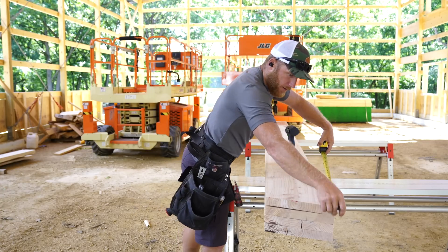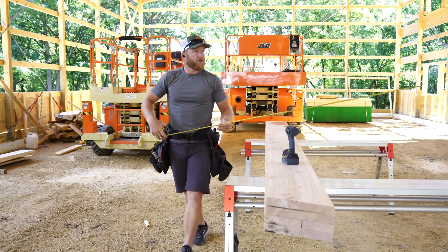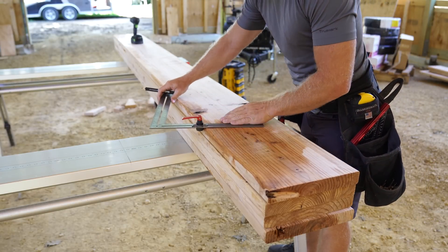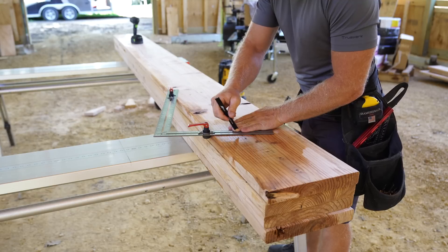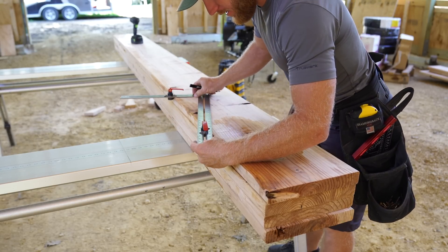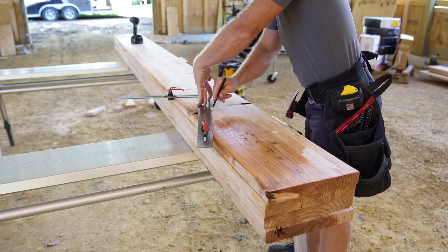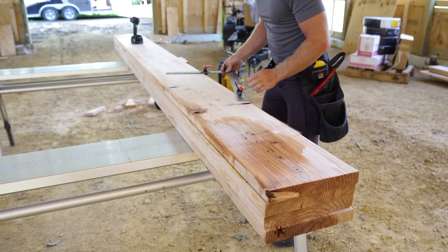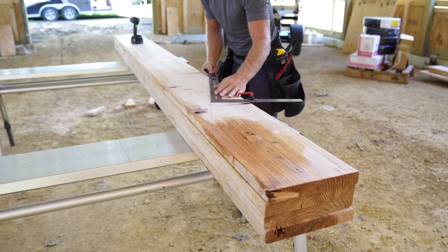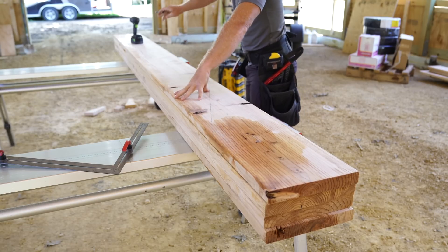I hook the tip here at ten foot seven and a half, and that is the long point of my reverse 4/12 pitch. When I say reverse 4/12 pitch — if I put this square like so, it gives me the same 4/12 pitch from that side. I flip the square over and now it's going to give me the exact opposite, so I can line up right where I put my ten foot seven and a half mark. I just flip it over and it's always going to be the exact same pitch. Now I have my reverse 4/12 pitch and it's going to create the perfect rafter.